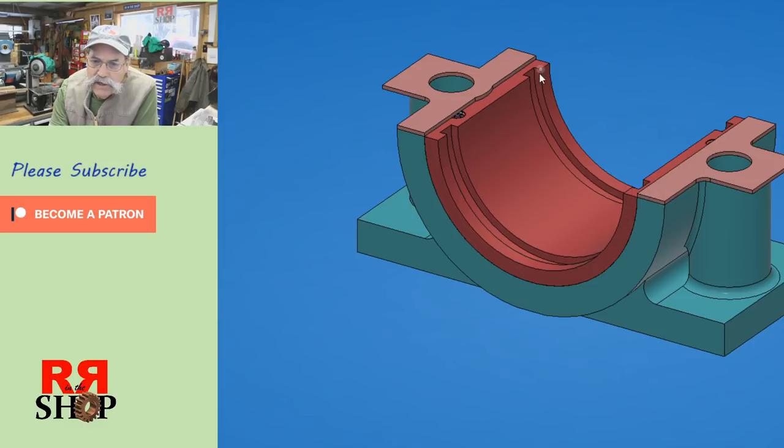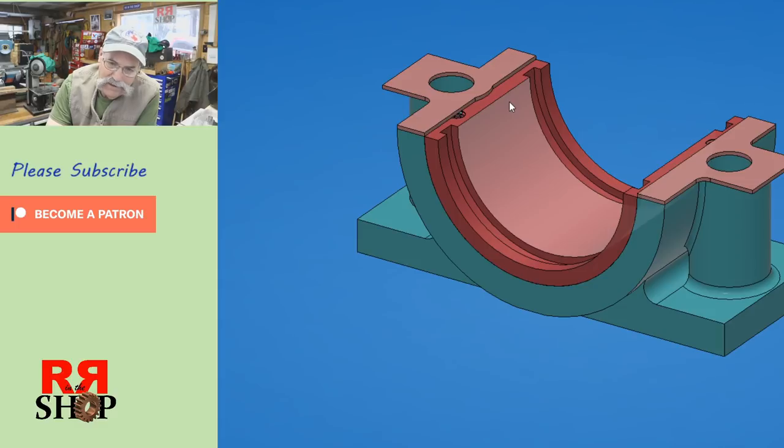We'll have, like I said, two grooves here. These two grooves will be for felt I'm going to put in here, and that's going to help keep the sand and dirt and water and everything out of the bearings. If sand does get in the felt, it'll wear on the journal a little bit, but I'd rather have that wear than the whole journal wear. But I'll bet you this will last 100 years. The mixer probably won't; it will go to scrap before then, even though it's very old now.